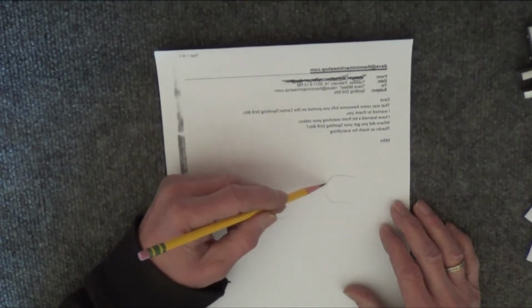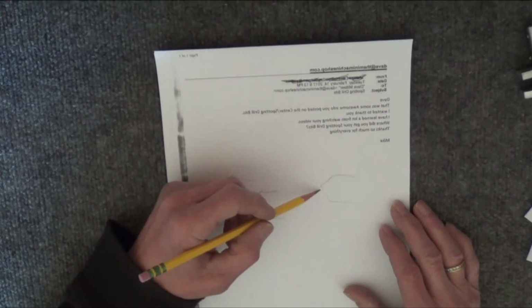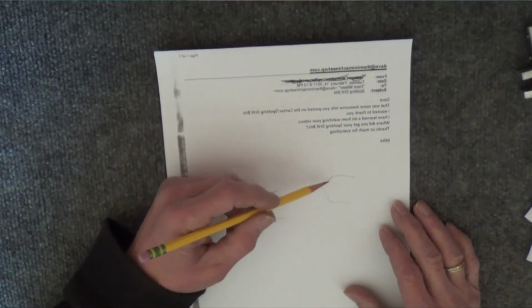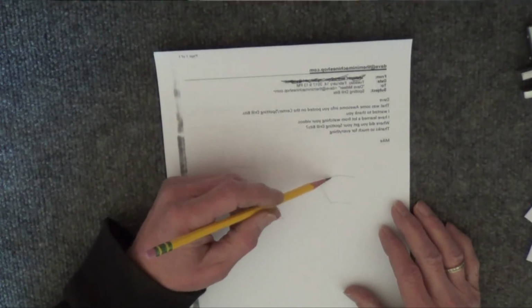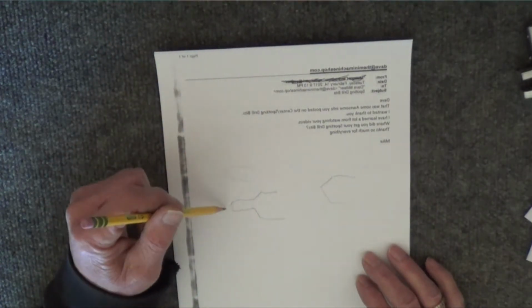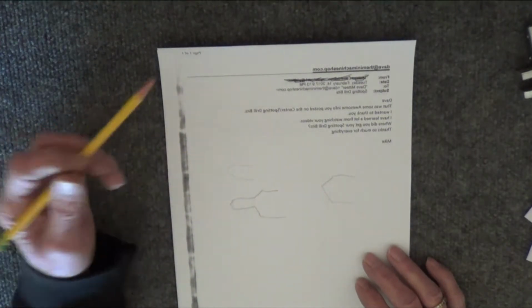So this is not used to drill your pilot hole. This is used to do your pilot hole, which really isn't a hole. It's just an angle which gets it started, and the flutes on the drill bit start cutting immediately so you don't get the wobbling effect. I did test both of these. This is better, even though I do this a bunch.